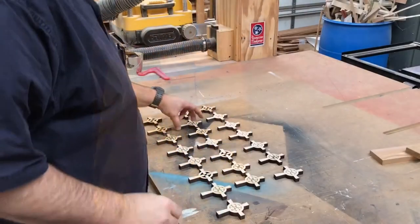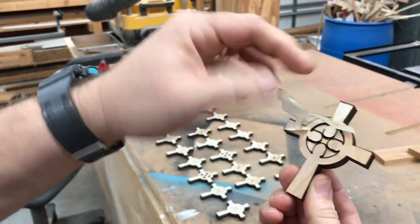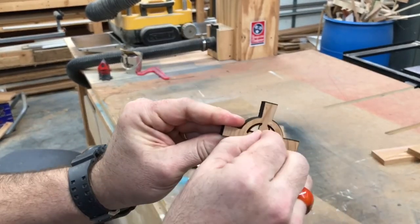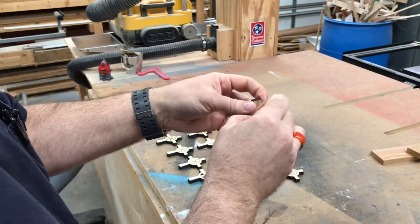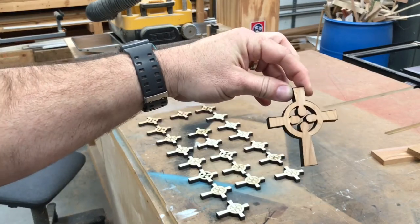Because the cutting process generates a lot of smoke, you have to mask off the wood with a masking material — it's kind of like a big piece of masking tape. If you don't mask it off before you cut it, the smoke will leave ghosting on the surface of the wood. If you plan on sanding everything, then that's okay, but it's a whole lot easier to go ahead and mask it off ahead of time. This is also the time I have to poke out all the little scrap pieces of wood that were left in the center.